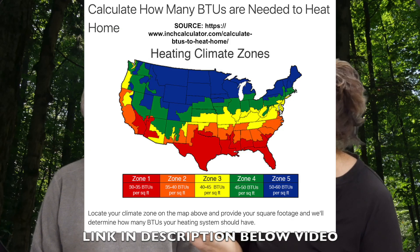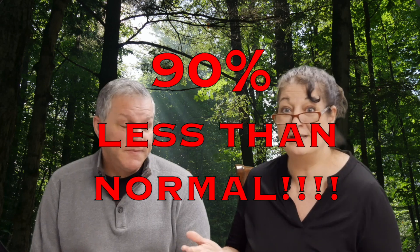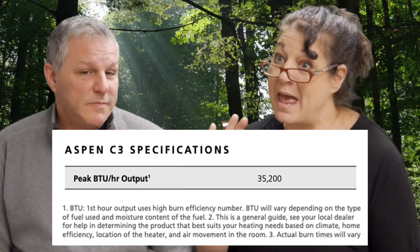A regular 1,500 square foot house would need 90,000 BTUs per hour in climate zone 5 at the high end. We're really zone 6, but we're using the high end of zone 5 for calculations because they don't really have data for zone 6. So we would normally need to plan our heating system for 90,000 BTUs an hour. But because it's an earth-sheltered house, according to the company that makes the kit, we should be able to use just 10% of that rating — so instead of 90,000, we should only need 9,000. This stove supposedly puts out 35,000 BTUs an hour, but that's at maximum capacity.